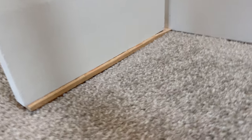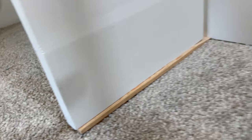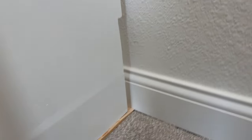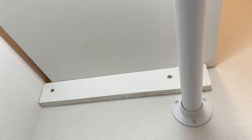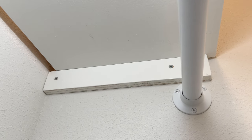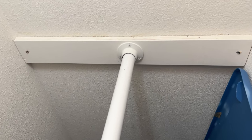I had to put this little strip in because my floor was actually uneven and I needed to support it. Also my drywall was not perfectly level, so I created a notch — I know it's kind of ugly but no one's ever going to notice it. You can see the variance is really small at the top but really wide down at the bottom, so be sure to account for that. These shelves are attached right there with a lip that finds a stud, and this piece here is also screwed into a stud.